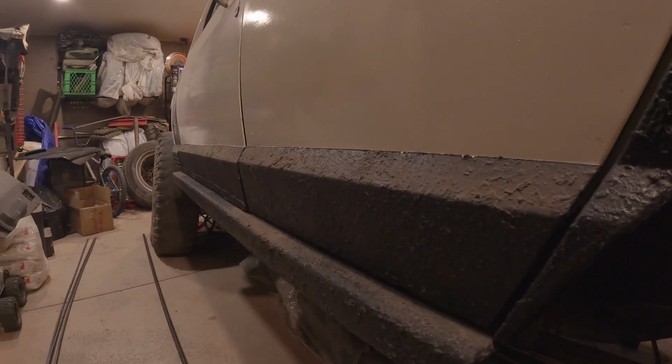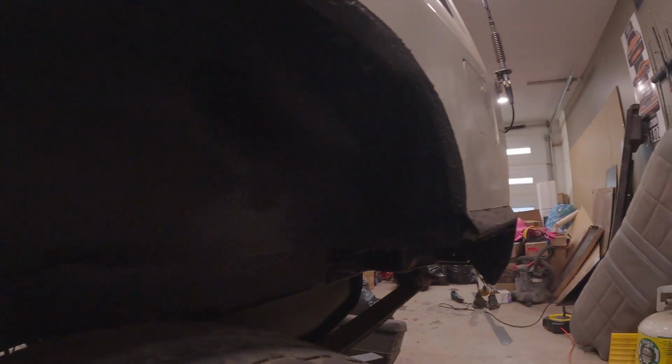Put the bed liner on. Bed liner the wheel well. And then run. But I just got to finish painting the side on the other one. I do the bed liner in here because you think of the bigger tires, the off-road tires, spitting rocks up and hammering this. It actually happens a lot here. I did it here as well. Bed liner. Just because it chips away at it, and at the front there, it creates holes in the floor. So that's why I'm doing that.